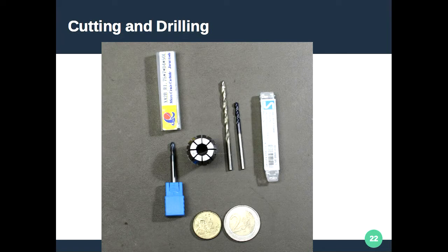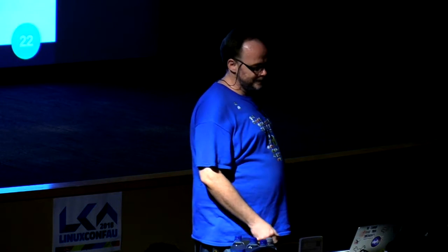For people unfamiliar with CNCing: in the blue plastic holder is a ball-ended cutting bit, and the collet which holds the bits is in the middle. You'll want a set of collets — they range in millimetre increments, five to six, six to seven, etc., and screw down with a collet nut. Also invest in a set of shorter drill bits: with a 3040 you get 55mm of Z travel, and a standard drill bit takes up a fair amount of that space. Shorter bits give you more flexibility, though you probably won't find them at Bunnings.